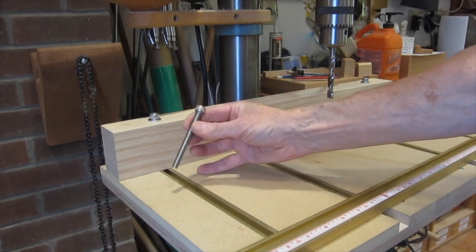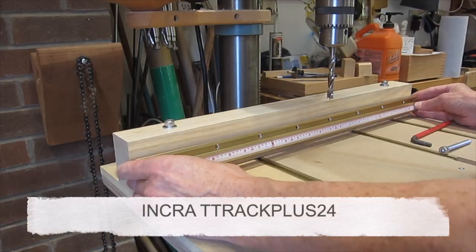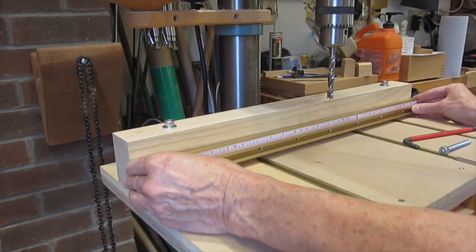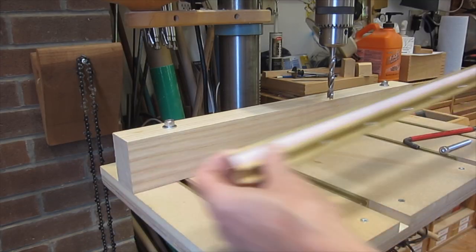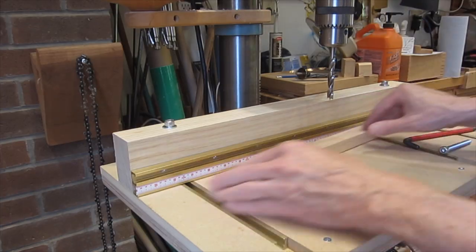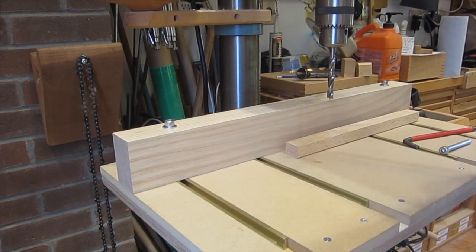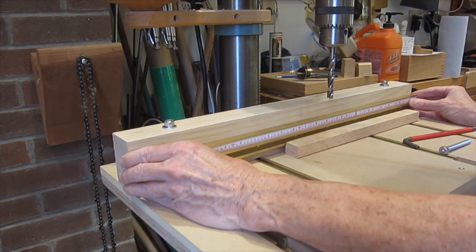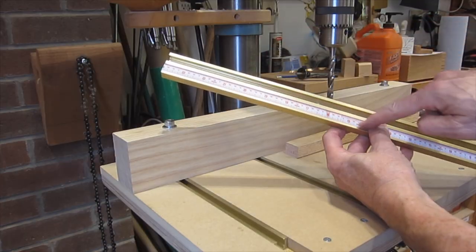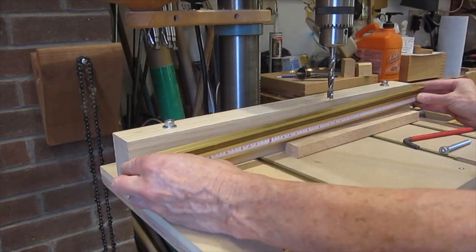I used an 80 millimeter long bolt. I've got this T-track with a scale — the way the measuring tape came, it was intended to be mounted one way, but I think it's better to mount it the other way so that if I have a shallow piece of wood I can move it along the scale. If it were the original way, the scale would be too high. So I slid the plastic ruler out, flipped it over, and slid it back in so the numbers are right side up.